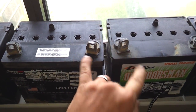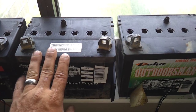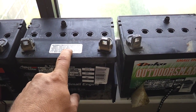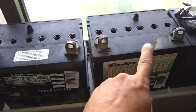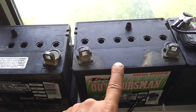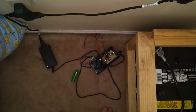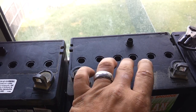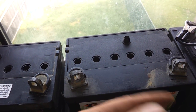They're the exact same battery. This one I have not touched yet besides popping the caps open and looking inside, so this one is definitely sulfated from what I saw. This one's been on my desulfater — which is actually currently on the ground down there in that little box — for three weeks. I just pulled it off real quick so I can get a good view inside. It's got about one week left to go.